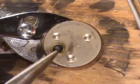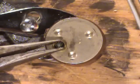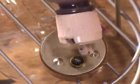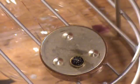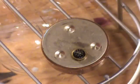It's been about 10 minutes and I can really feel the heat coming off this. Use a pair of pliers to take it off and have a look. Remember this gear was completely seized solid 10 minutes ago — look at that, it's moving now! We're going to put a drop of oil in there and it'll pool up underneath. As the rotor cools down it'll suck up the oil, mix with the existing oil to rejuvenate it and get this thing running again.